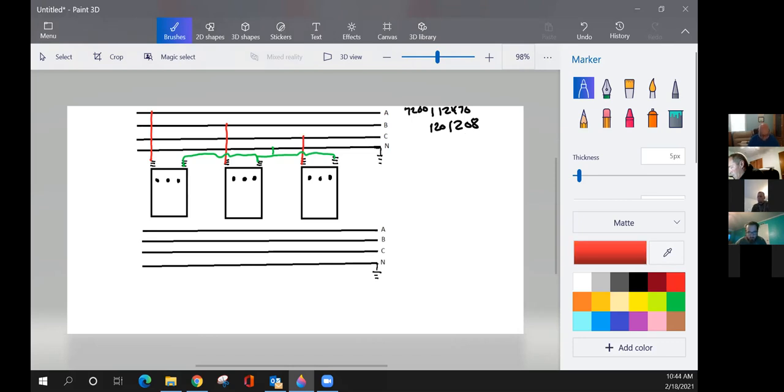Now, secondary side. Well, before we get into that, remember the video we saw where it showed the A, B, C, and D on the inside of the transformers. Well, this is the only kind of transformer that I know of where you're going to have to go inside and parallel the windings in the transformer. And why do you do that? Because you only want to get phase to ground voltage of 120 volts out of each transformer. So you saw the markings in the transformer. A was on one side, B, C in the middle, D was on the other side. So you want to parallel them. AC will be tied and BD will be tied. AC, alley cat, BD, bad dog.